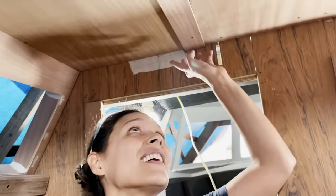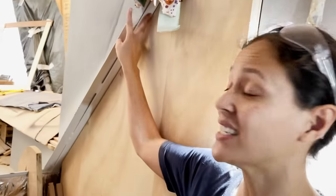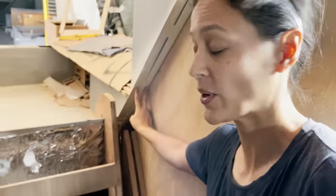Last week we were talking about how we could make a 34-foot boat feel like a 40-foot boat. Now, that comes in certain design elements, and we wanted to apply this technique on our ceiling as well. So as you can see here, this is a stripe that continues all the way down the ceiling of the main cabin. It will continue and line up directly with the companionway hatch, and it'll also line up with the staircase. What this does is create a continuous line that your eye will follow and give the cabin a sense of increased depth.